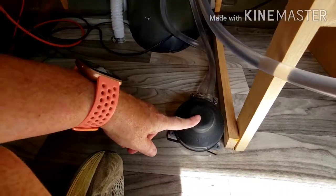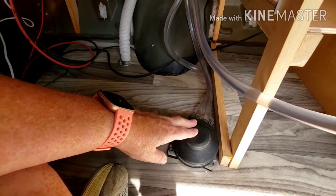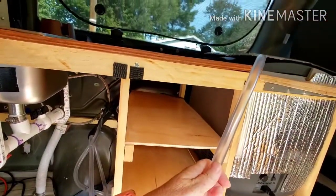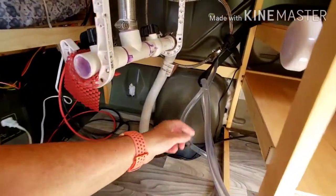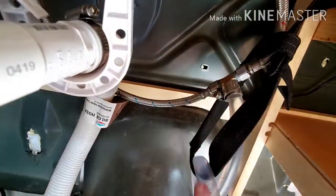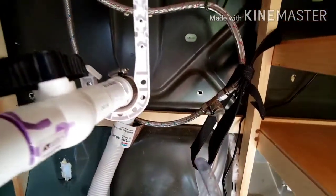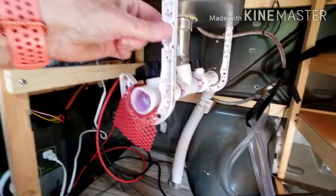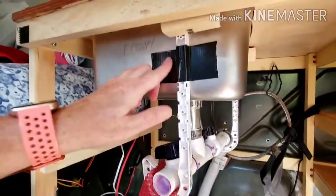We have this marine foot pump that makes the water come out nice and slow, which I wanted, and your hands are free. One hose goes into the fresh water tank — I just have it positioned here so it doesn't spill water on the floor. Then it goes through here, and we had to adapt it with clamps and everything to go to the faucet. That was the trickiest part. We have this stuff kind of hanging here because it was getting kinked up, so we did whatever we had to do to prevent kinking. These are just some pipe hangers to support it because it's pretty heavy.